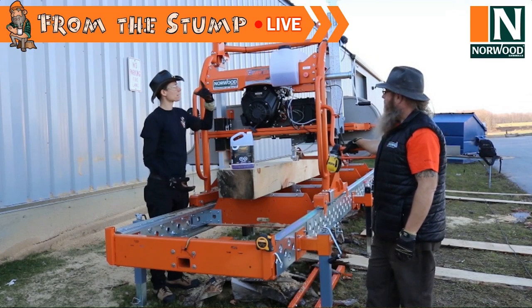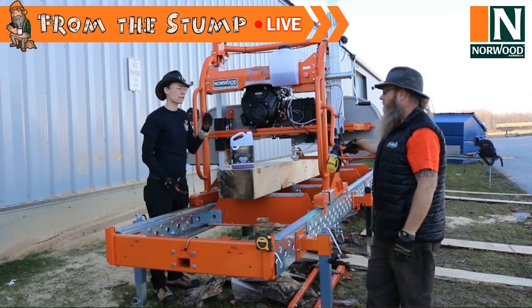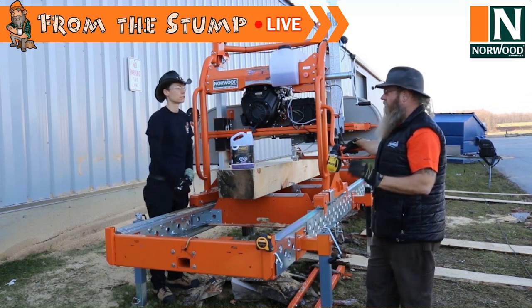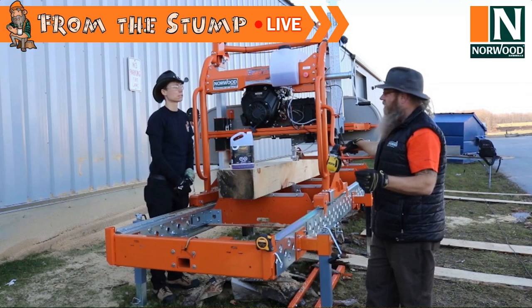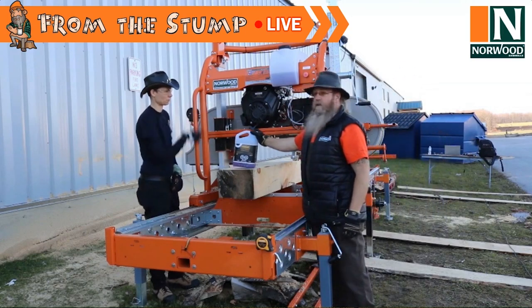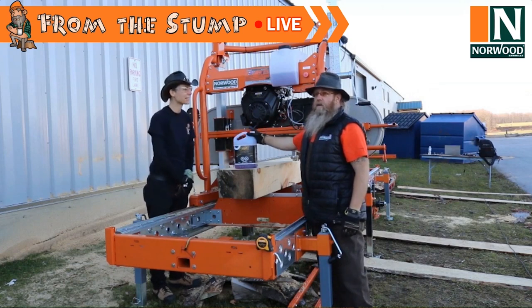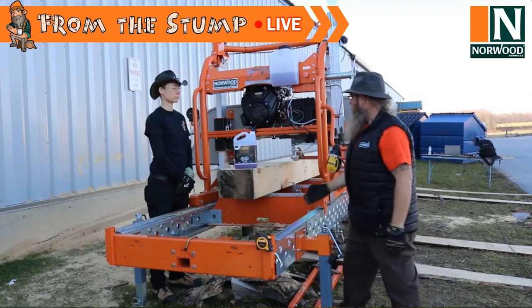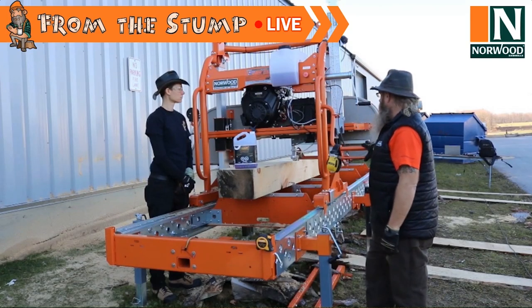Now, would you add soap if you were cutting something sticky? You can, but not nearly as much. It'll gel, it'll congeal on you. Always do it in here before you dump it in, and then shake it to death, so it mixes in as well as possible. That's the big thing to do with that. Now, drip rate.